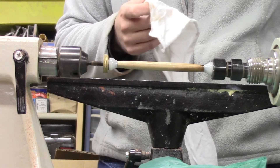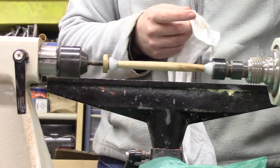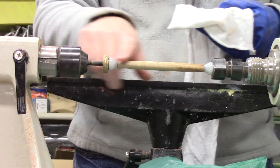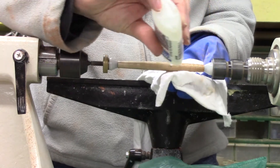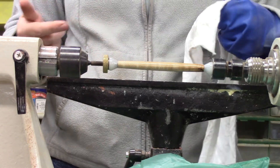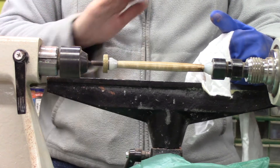Use your ungloved hand to check if it's still sticky — and it is just a little bit, so let it dry for a little longer. That's going to be really pretty. This one — I actually do think it's maple — had a knot on one end so the writing tip end of the pen is darker than the other, and it's very pretty. Turn the lathe back on and do coat number two. The whole reason for not spinning the lathe with the activator is that I've found I get stripes on my pen if I keep it spinning, so that's why I stop it and do it by hand.